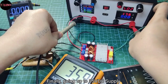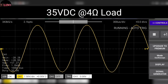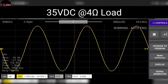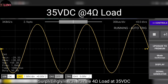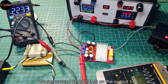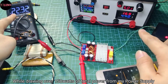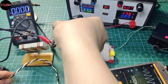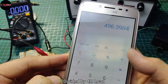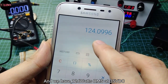Going up to 35V DC supply. We got 22.28V RMS on the output. Surprisingly, it can handle a 4-ohm load at 35V DC, while drawing over 150W of total power from my power supply. So that was 22.28V RMS squared divided by 4 ohms load, giving us around 124W RMS at 35V DC.